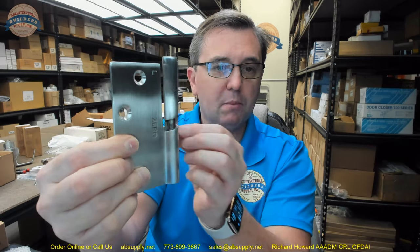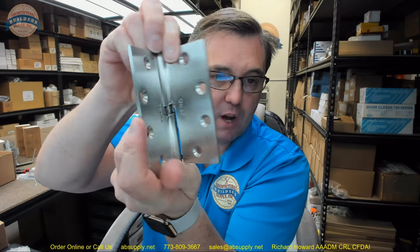The purpose of this cam lifting action is simply this: the door is constantly being pulled down to the ground. Because of the cam lift profile of this hinge with these spiral-type cuts, that weight is always forcing the door to close and seal tight against the seal that's been applied to the frame.